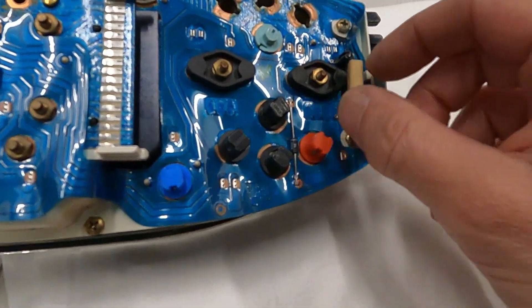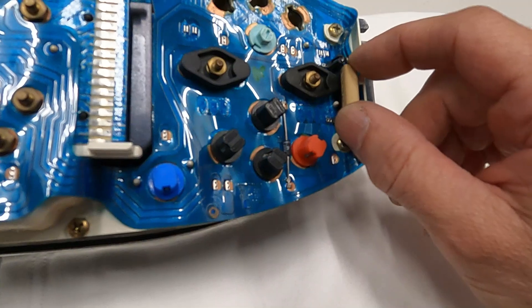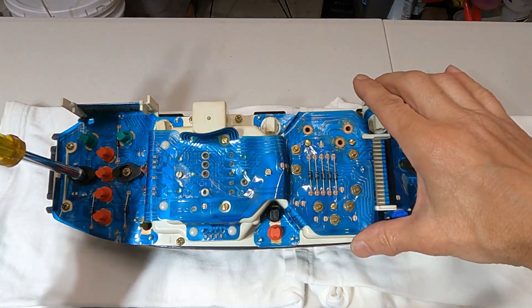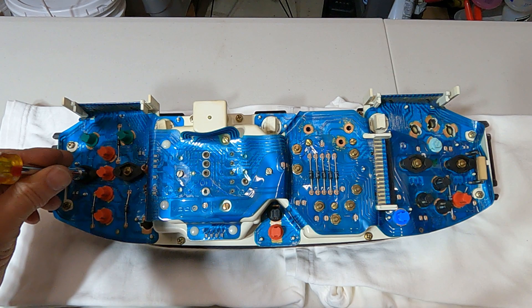We've got a couple of these football connectors here, and this resistor. A lot of these things have a crimp fitting that is not soldered, so we're going to take a good close look at those and make sure the contacts are clean. With a 7 millimeter we can take these little brass nuts off. The process involved removing each of those football-shaped connectors and cleaning them thoroughly — clean all the contacts, clean the brass nuts. I used isopropyl alcohol, but you can use your favorite solvent, a Scotch-Brite pad, or anything like that. Put them all back in place and snug them up, and that makes the connection a lot lower resistance.